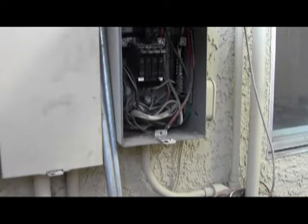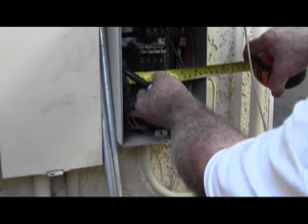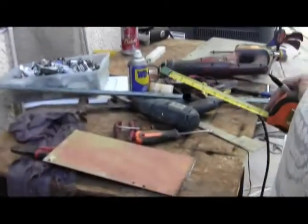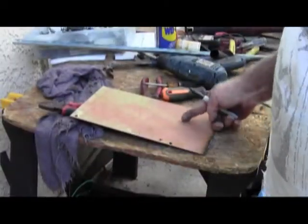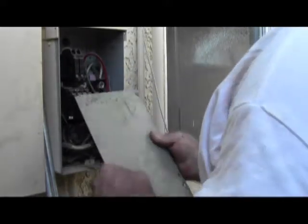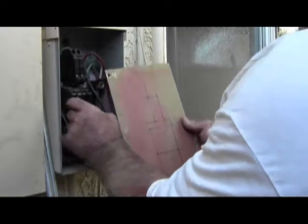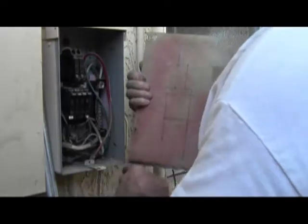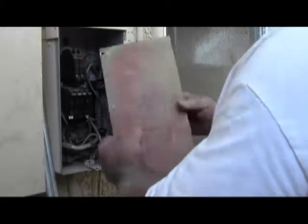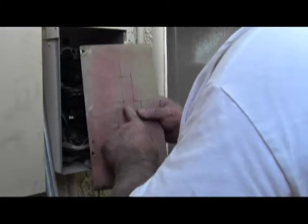The first thing to do is to start measuring backwards. We're going to call that an inch and three quarters, and since it's backwards, that would be an inch and three quarters on this side. Here is a mirror image layout, so this is the back cutting edge so that you don't see the cut marks. This distance is actually this distance and this distance is this distance. We had to add a little to this lip here and I basically allowed for about an eighth of an inch of slop.